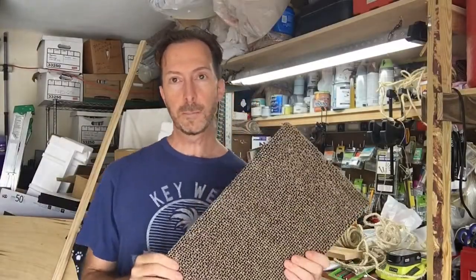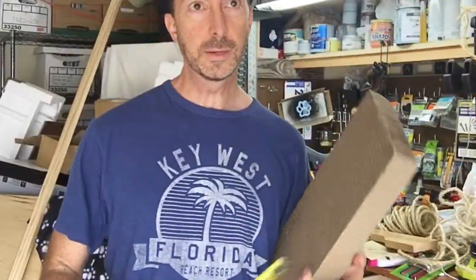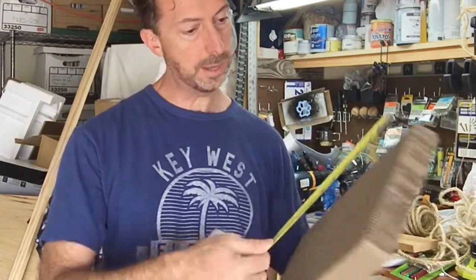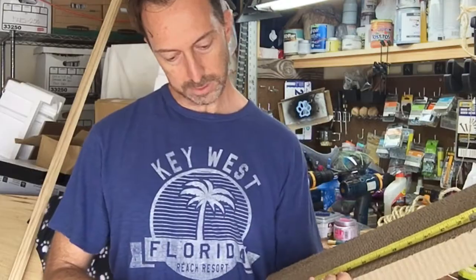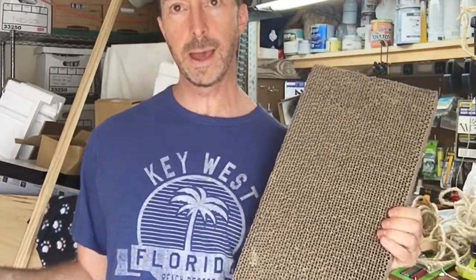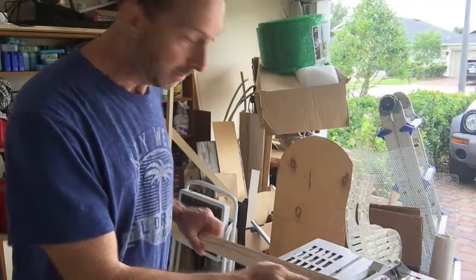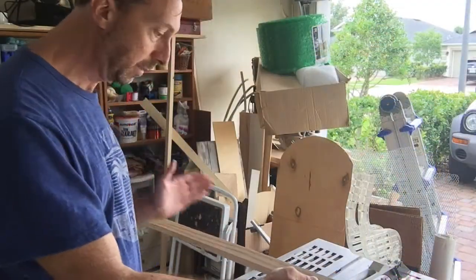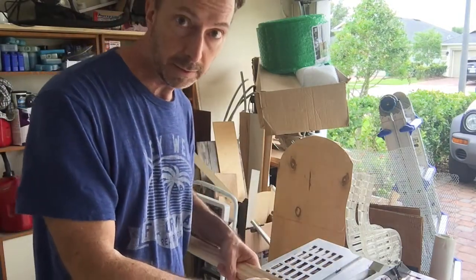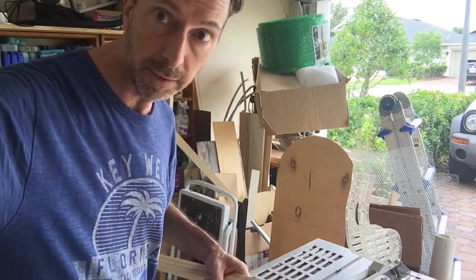First I'm going to make a box with a seat for the corrugated cardboard to actually go on the rungs on the bottom of the chair. These scratch pads come in different sizes — this one is nine and three-eighths by seventeen and a quarter. You want to make sure it fits between the front and back supports. I've marked out four pieces: two that are nineteen inches in length on my one-by-two, and two that are nine and three-eighths. I'm going to cut them on my table saw.